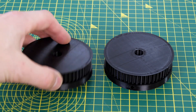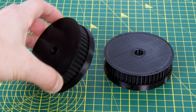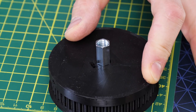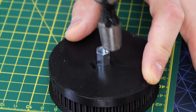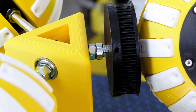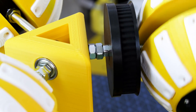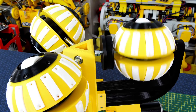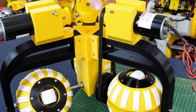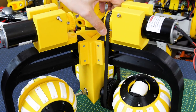I've 3D printed pulleys for the axles on the wheels. I've allowed provision for a captive nut and another screw, but what I'm actually going to do instead is hammer in a hex spacer which is hex-shaped into a round hole - that's a really tight fit so I think that'll hold fine. Then I can just do a nut up against it and that'll hold it onto the M8 shaft which I'm using as an axle, and that's the same principle that's holding the wheel on. The belt's installed and that seems pretty tight and will have no problem turning that wheel with the motor that's already geared.